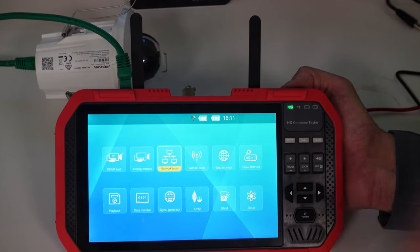The last menu is setup. Connected to Wi-Fi — the green icon is visible — I can view upgrade information and check for new firmware. Version 1.0.197 is the latest and I upgraded it yesterday. It's very important to upgrade periodically — connect to Wi-Fi, check for new firmware, and do the upgrade process as it improves functions, features, and stability. You can also change language, keypad tones, backlight brightness, system time, and date. The two battery charge statuses are visible — both are fully charged.